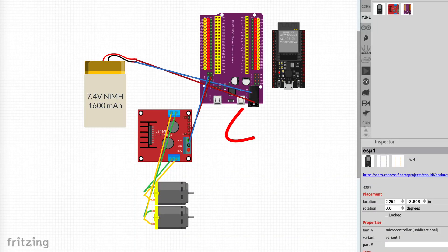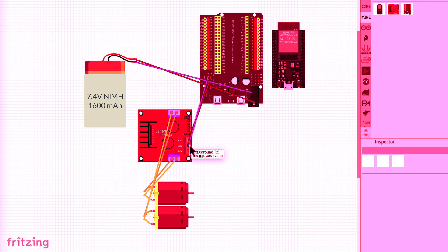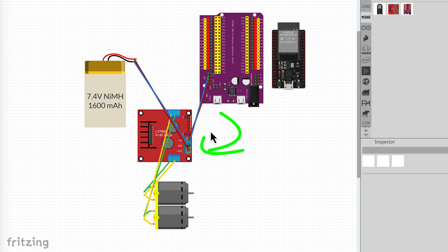Then when I got a new expansion board and connected the battery to the barrel jack of that expansion board and 5 volts to the motor controller, I quickly realized that the ESP32 starts rebooting as soon as the motors encounter any resistance. The solution was to connect the battery directly to the L298N module and take 5 volts from the module to power the ESP32.